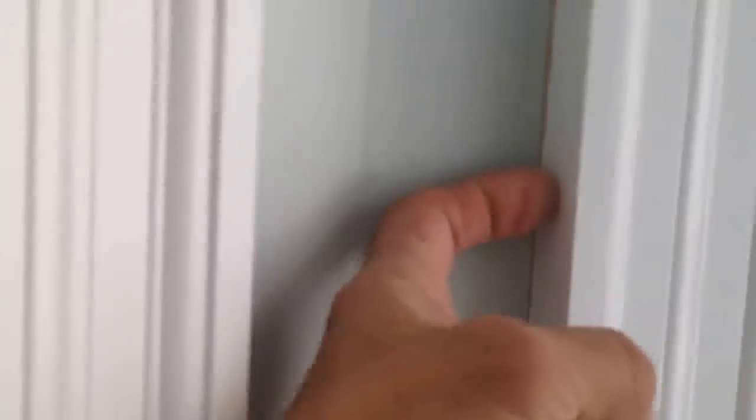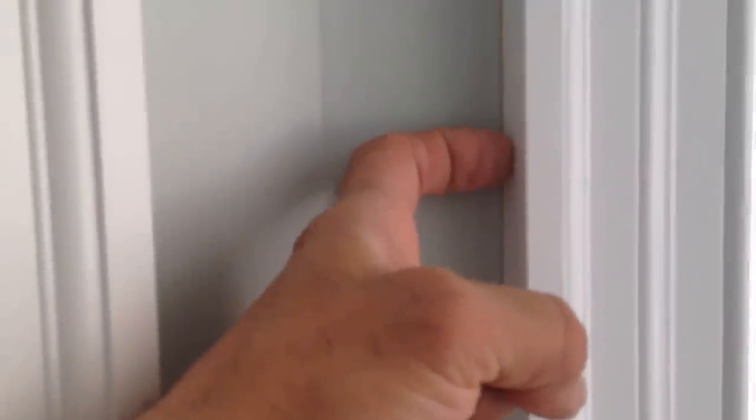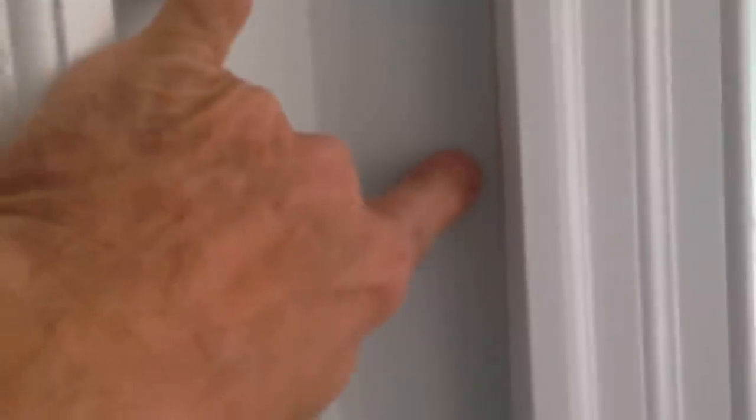I haven't taped this up — I just wanted you to see this. There's no way you can get a brush into a 90-degree angle in such a tight spot — you see how my finger is? How do you get a brush to go into a 90-degree angle like that without actually painting the wall? You can't do it. No one's that good. I'm not even that good. So what I'll do is tape right along this edge. If I get trim paint over this way, it's no big deal because the tape is going to save me the grief of having to come back and touch this up. I left this alone just to give you that example.